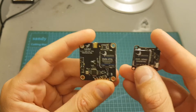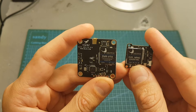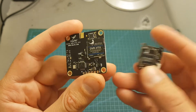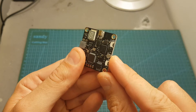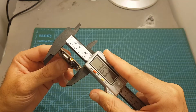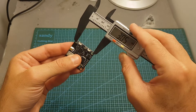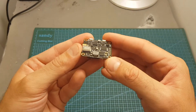The specifications of the on-board DVR are identical to the DVR-Nano, so it records video at VGA at 24 frames per second. It supports both NTSC and PAL. The main difference is that the DVR-Nano doesn't have an on-board microphone, whereas the DVR-VTX does and it records audio directly on your DVR. The board weighs 7.86 grams and its dimensions are 36.3 by 36 by 6 millimeters. The distance between the mounting holes is the standard 30.5 millimeters, enabling easy mounting on top of your stack.